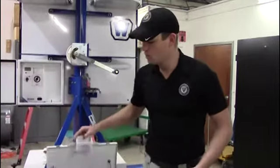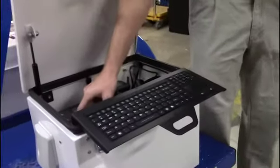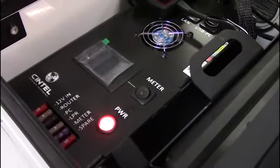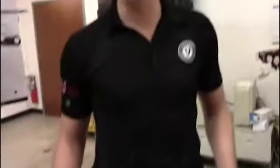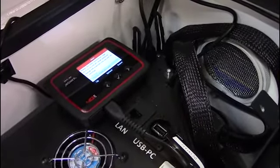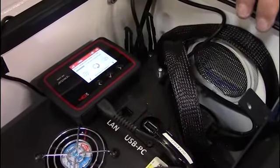Your electronics box — open it up right here. You're going to have a flip-out keyboard. Then you're going to have a single power switch that turns on the entire unit — one button push. You'll see that light come up red. Then your MiFi is going to come up. On your MiFi, you're going to select the right arrow key once. It's going to say charge or tether plus charge — you want USB tether, so it's tethering the Wi-Fi connection to the computer inside this box. Select USB tether on, and it's going to tell you you've got signal.